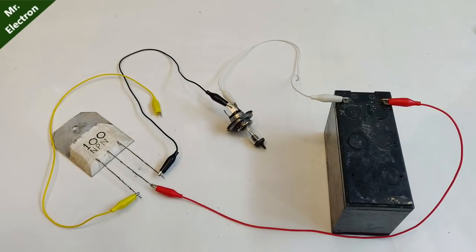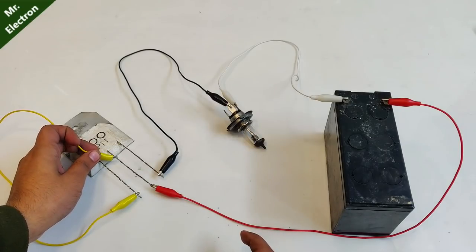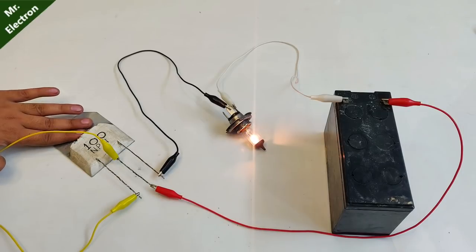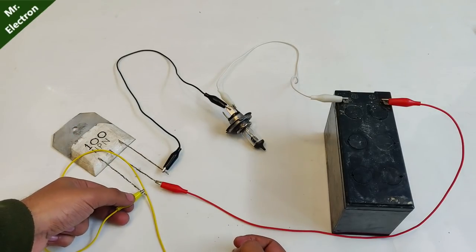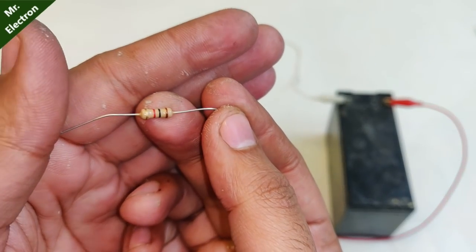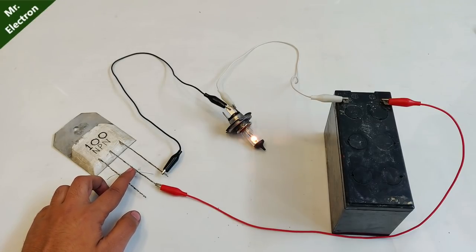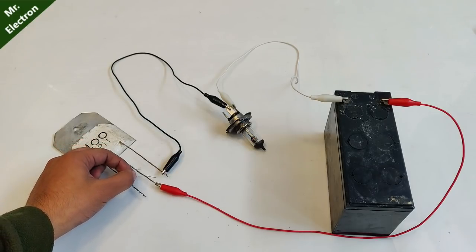The black wire is negative, so negative will be connected to the emitter. As you can see, the bulb is not lighting up because the base is not connected to the collector. Let's touch it — the middle one is the collector. You see, it is glowing pretty bright! Nice, and heating is negligible — no heating, to be specific. Now I'm going to turn on this bulb with the help of a one-kilohm resistor. It is glowing with the help of just one kilohm resistor!